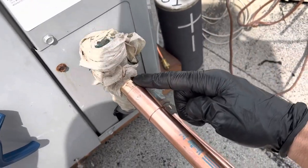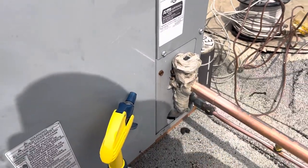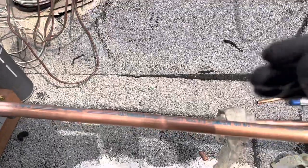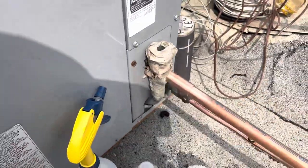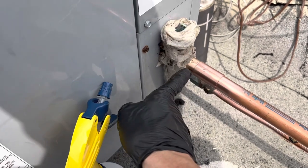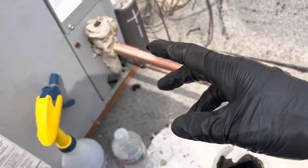Keep your flame going away from the valve. Don't come here and have a flame going up under here and heating up down there — you don't want the heat up. Try to keep your flame in the direction away from the valve itself. Too many guys complain of sight glasses leaking, valves leaking, or expansion valves going bad. It's because they don't thoroughly have enough cooling on the devices themselves, and they often heat the valve by pushing the flame right in here like this, and they heat up this core right here, and it ruins the seals inside there. Same on expansion valves.